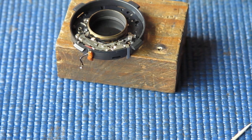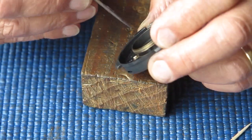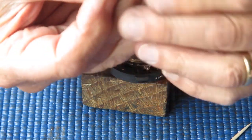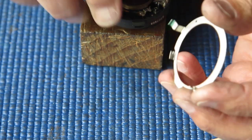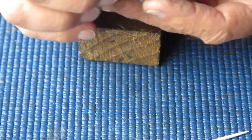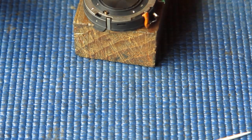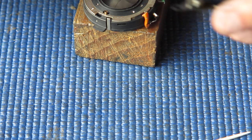So far, so good. Yeah, there's a detent spring in the case at this point. I'll just put a wipe of molybdenum on there, and on this little ratchet area here on this settings lever, then this can drop into place. To make sure I get the pin on the right side of the return spring, that's good. Otherwise the spring won't be returning it, it just won't work properly.